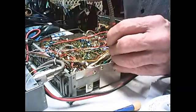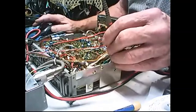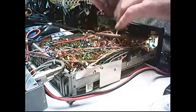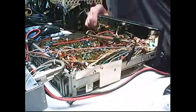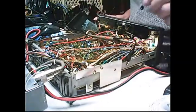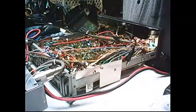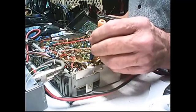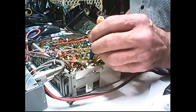So how do we fix that? Well, I've adjusted what I can, and it's just not good enough — it won't go far enough. What I'm supposed to adjust is right here, this little trimmer, and on lower sideband get the 8.21340. Well, it won't go far enough.